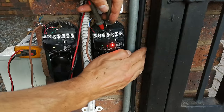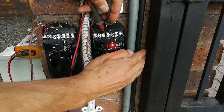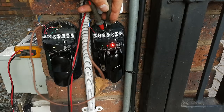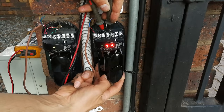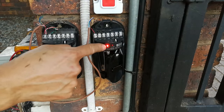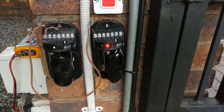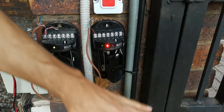What happens is if I break the beam, it opens — meaning there's an intruder or somebody has come into your garden. If it's not aligned — if it's off the axis — you can see it's not good. So you have to stand here and get it to when the level indicator, the green LED, comes on. That's not enough though; I need to get the green LED on to confirm the level is correct. I need to get it correct in terms of direction but also in terms of inclination.